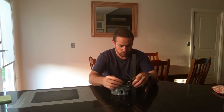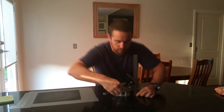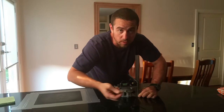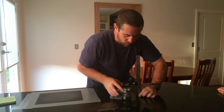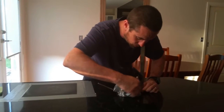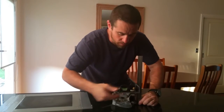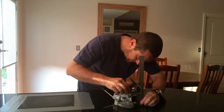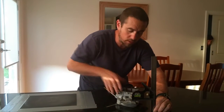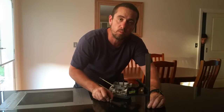Once I've ground it down enough, if I put the square on here you'll notice there'll be a gap. I can use my feeler gauge to measure that gap, and as soon as it just fits through I know I've measured it exactly right. I'll do the same thing on all sides to make sure I've got it as accurate as possible — just tap it underneath in between the square and the top of the head. I need to make sure the combination square is perfectly flush.